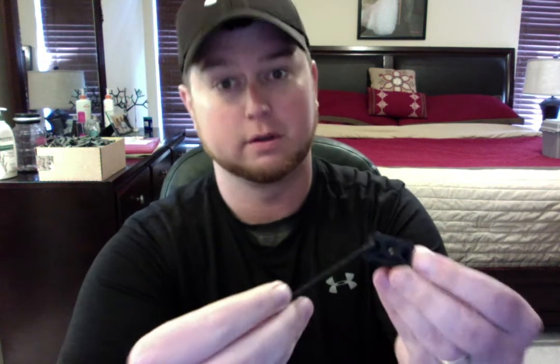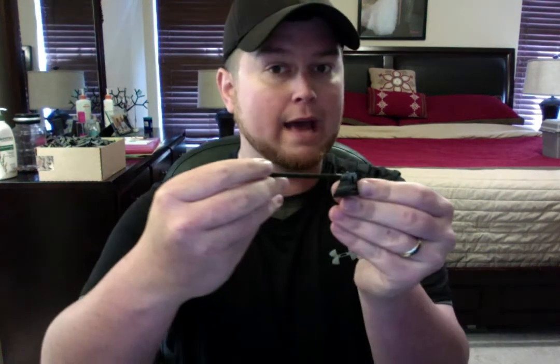What ended up happening was this: the little recess where the nut is supposed to be — apparently, this backed all the way out into the stock, and that nut fell into the receiver itself. Somehow or another, that little nut wedged its way in between the hammer. When I pulled the trigger, the nut actually prevented the hammer from striking the back of the bolt and thus prevented it from hitting the firing pin. I heard the click — the hammer came forward, but it never made contact.